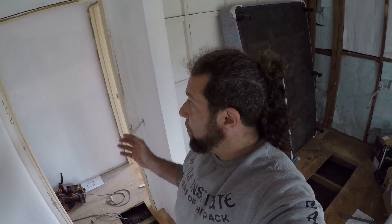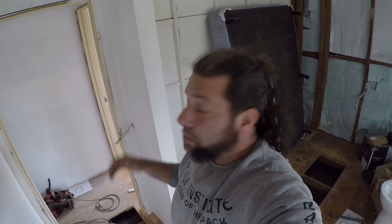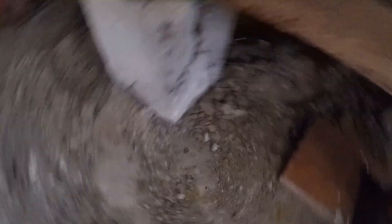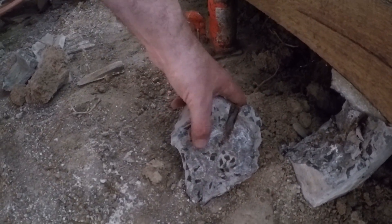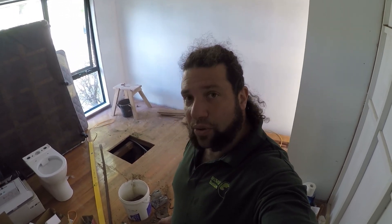Here we've got the door jamb and we've got a weight point where the stump has split, so we need to make sure we've got those correct. Once the house is all finished, plastered and painted, we need to get this part right now because we're not going to have a chance to get back into it later. We're going to put an overlay floor over the entire thing. We don't want any big structural cracks appearing — we want doors to be able to swing for a good 50 years without any work being done to them. Once the house starts to slip or move and crack, doors will always end up getting stuck and we don't want any of that. Here I've got the bearer propped and this stump — one of the stumps with the big split — is broken in half in my hands. You can also see that the pin has rusted in there, which has brought moisture inside the stump and made it twice as brittle — a bit of concrete cancer. We've got an additional 12 stumps that we've got to do; that wasn't part of the original quote, so that's a variation to the actual build cost and you need to make sure that you vary that.